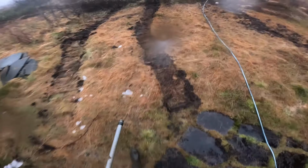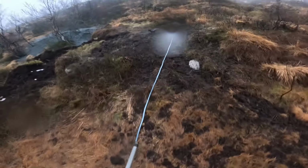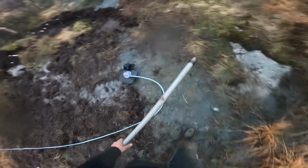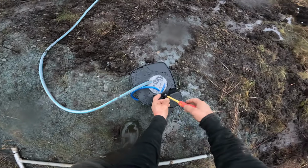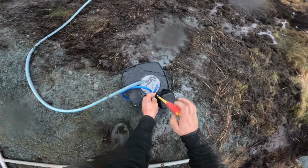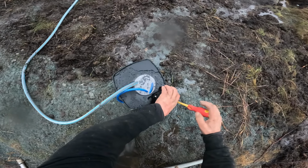Now I have been filling it because the customer has a water source from a small river, so that the pressure will get high enough. Because if you make an explosion without any water inside the well, then the pressure will be too low on top of the charge, and also the pump is much easier to pick up when it's full of water.